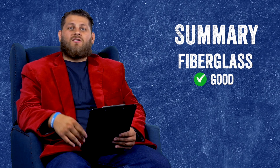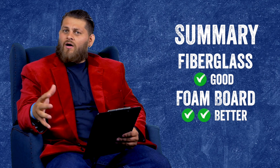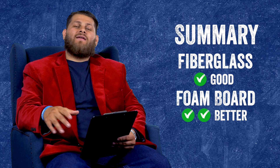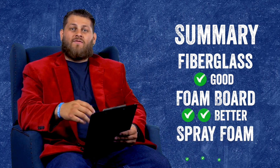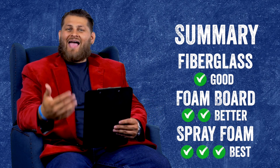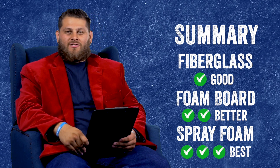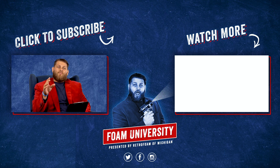So what's the best option for you and your pole barn? It all comes down to your priorities and goals. If you want the lowest cost option that's readily available just to get the building complete, fiberglass would be a good way to go — you can likely finish it in a weekend or two with some help. If you want a step up with an air seal and better thermal resistiveness and still want to do the project yourself, foam board would be a good option. And if you want the absolute best — something you don't have to worry about over the years with no added steps — and you can afford spray foam, that would be the clear-cut option. Check out the links below to learn more, and don't forget to subscribe and ring the bell for all our notifications.